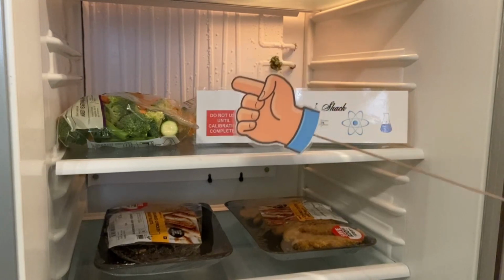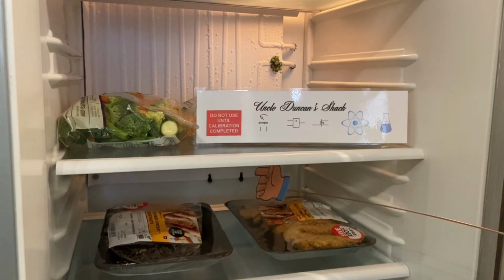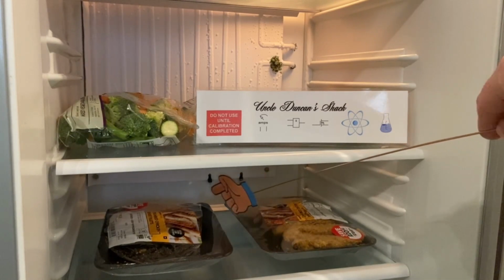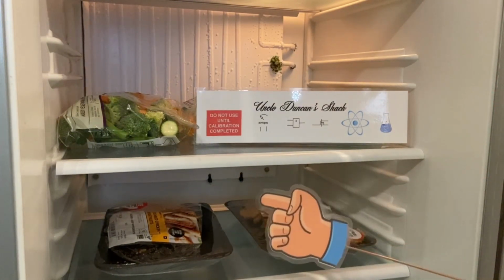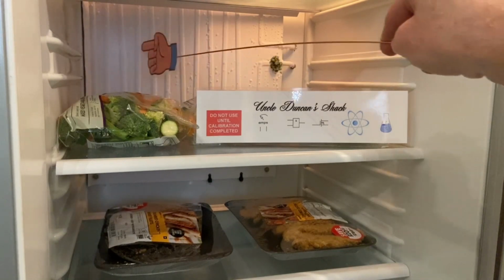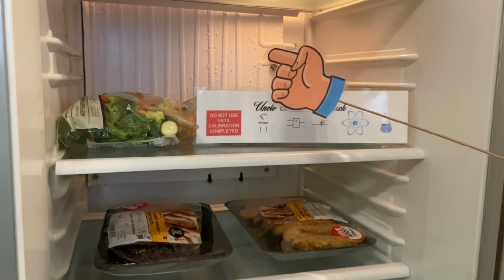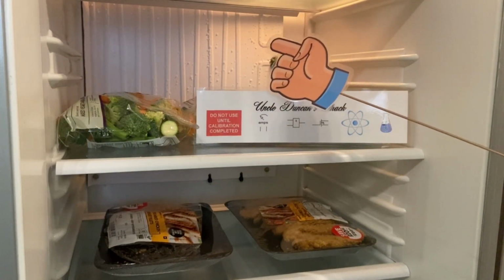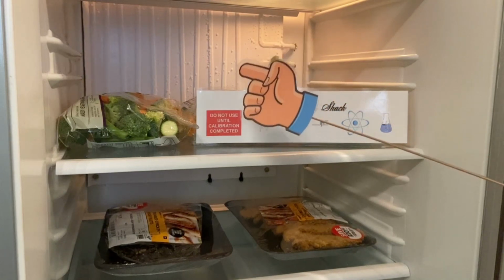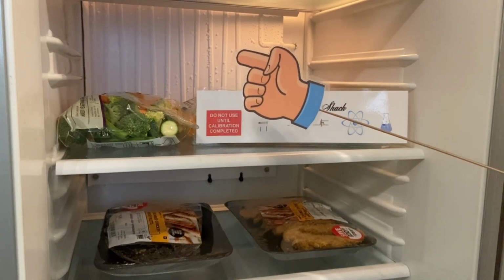It works very well. Down the bottom I just made sure that the plate is bent down, because down below is the original drain channel for the condensate to go into, as the ice over here melts during the off cycle. This is a thermostat that makes sure that the evaporator is warmed up to above freezing before allowing a restart. It's got a fixed cut-in point. Anyhow, let's go around the back. Let me hold this out and I'll show you what I did at the back, and then I'll conclude this video.